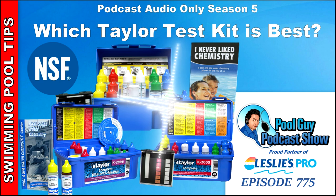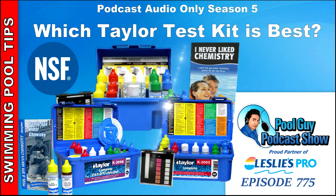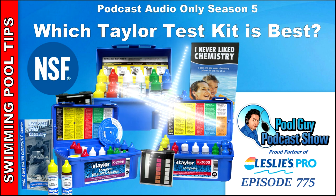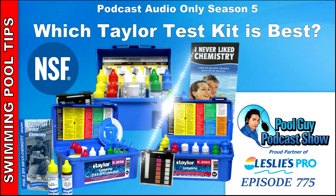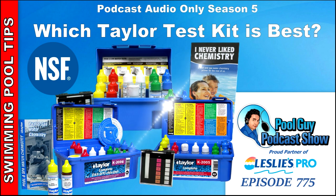I wouldn't say all the tests are subjective. Some people argue the reagent test kit isn't accurate because you have to determine the color by looking through the tube at the color indicators. But really, the colors are pretty clear. If you're in direct sunlight and holding it up to eye level with the right amount of reagent drops, you'll get a good color indicator of the actual reading. There's not a lot of guesswork with the alkalinity test — once it changes color, you stop counting. You can easily tell a chlorine level of 3 versus 2 parts per million, or a pH of 7.8 versus 7.2.